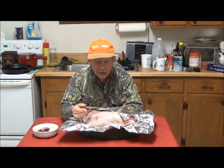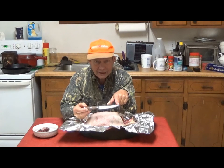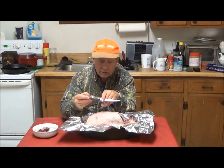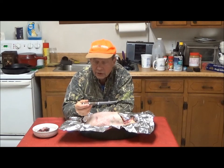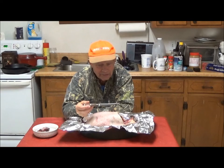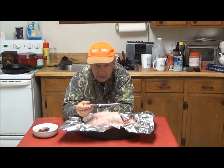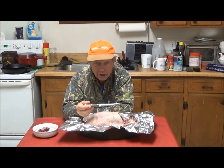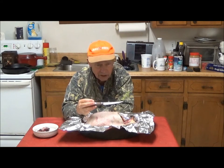So far as the knife goes, although I have refurbished it, I was unable to change the basic character of the steel. This point is still pretty weak and pretty soft — I actually bent it slightly while working one of the joints. It won't stand putting the point in and twisting, and lateral pressure in this direction. The steel is just not up to it, and nothing I can do about it outside of re-heat treating the steel, which gets to begin making an entirely new knife, which I'm not prepared to do. However, for cutting as a steak knife, or for cutting meat or soft objects, as long as you don't put lateral pressure on it, it does quite well. So this could be perfectly satisfactory as a steak knife, but not so much as a utility knife or a boning knife — it just doesn't have the strength in the blade for those purposes.